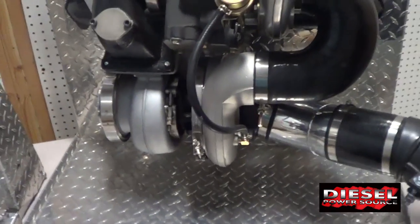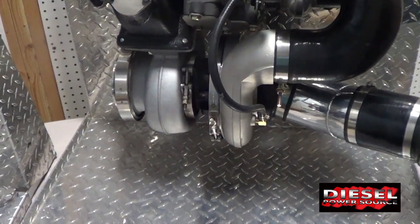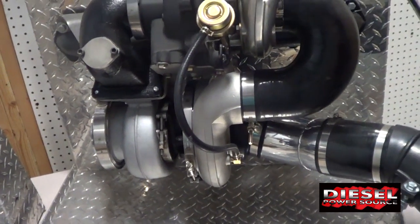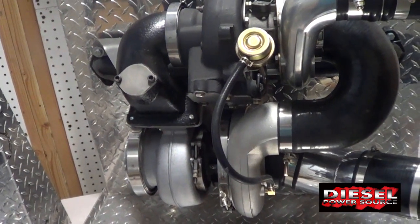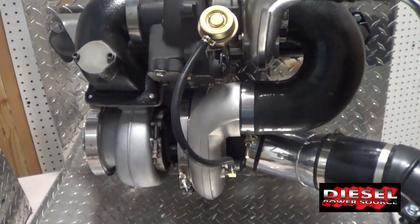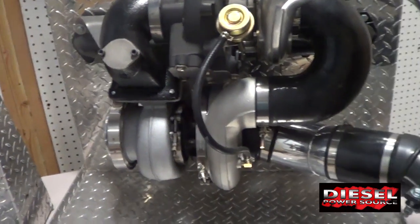And if you think about it, that's what a jet engine does. A jet engine always puts the compressors on the outer — the first compressors are always the big ones and the secondary set of compressors are always the smaller ones as it pressurizes that air. On the exhaust side in a jet engine, they go through the smaller turbines first and then exit into the larger turbines.